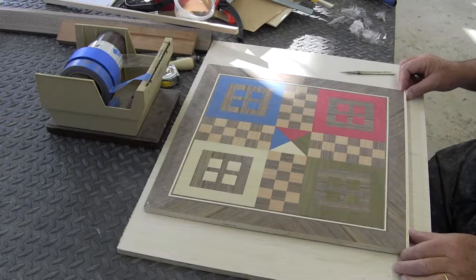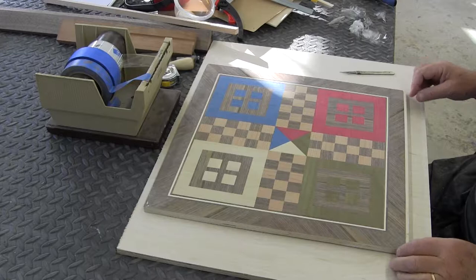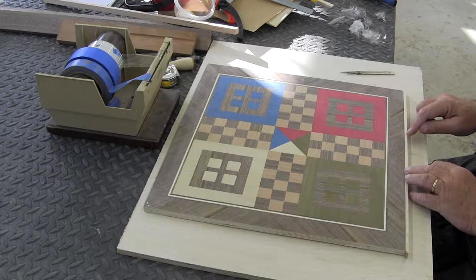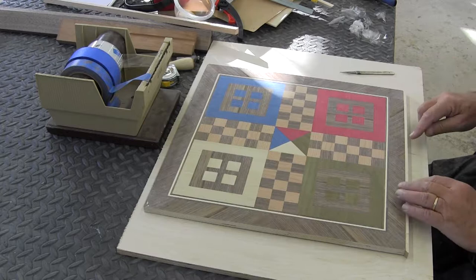One of the tricks — this is a fairly straightforward thing to do — a couple things to keep in mind is the thickness of this edging. You don't want to go crazy with this if you can avoid it, at least for this type of application, because this wood is still going to move even though it's a small piece of wood. The thicker you make it, the higher the probability that it's going to separate either in the corners or do something wonky. So this is about a quarter of an inch thick, and that seems to be a pretty good thickness.